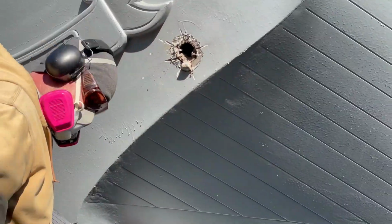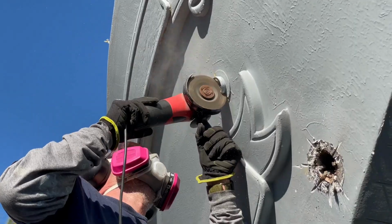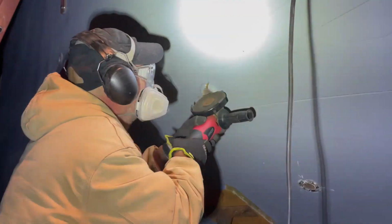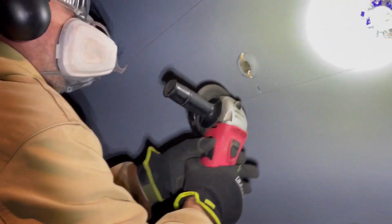Stratego's Thru-Hulls are primarily seacock valves. If a Thru-Hull fails, it's one of the fastest ways to sink a boat. The valves should be regularly opened and closed, hose clamps checked, and attached hoses inspected for cracks. This was our main concern with the Thru-Hulls when we moved Stratego to Washburns.